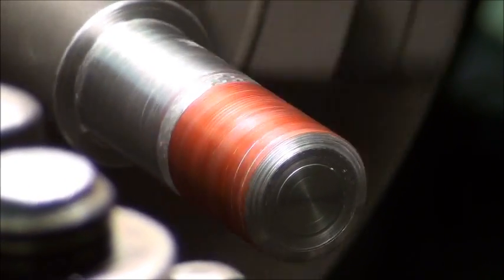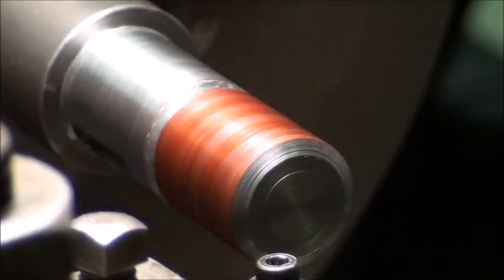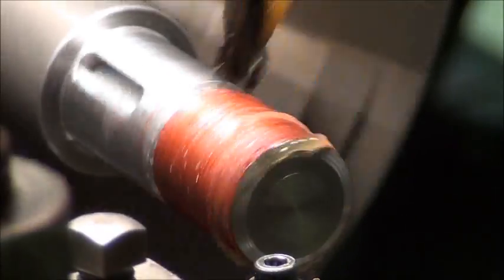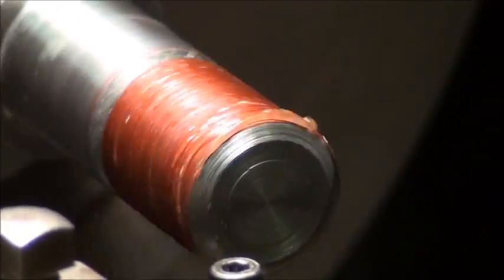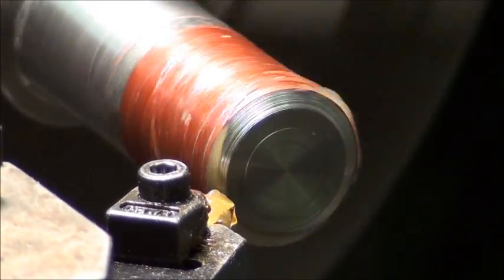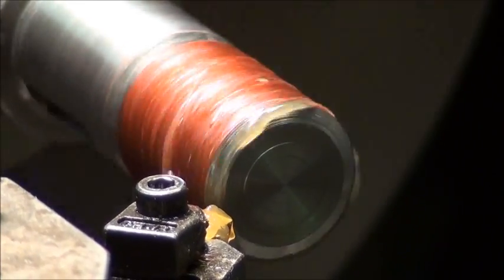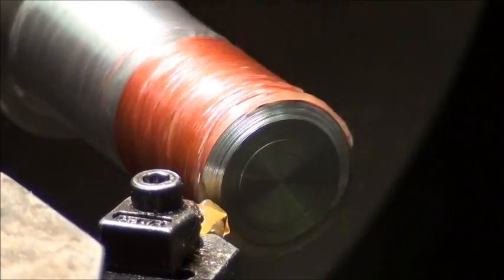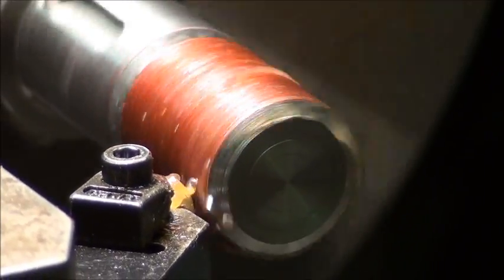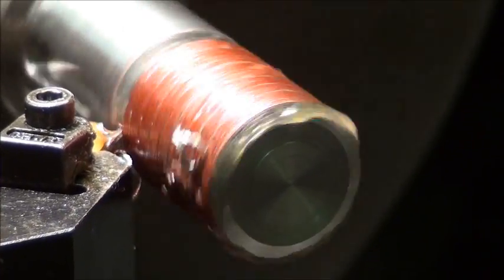It's nice and slow. I'm bringing it up and I'm going to put a little bit of this on it, just because — it won't hurt it, that's for sure. So I'm going to take a 10 thou cut first. Line it in. Wait for my number to come around, remembering that I can start on any one — but lucky me, one's there.